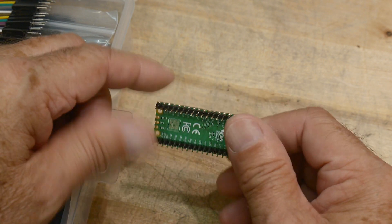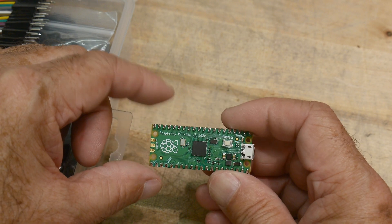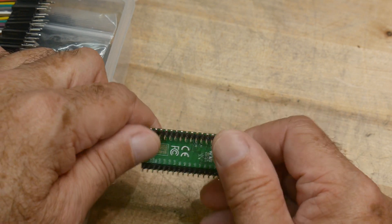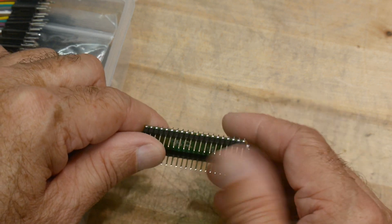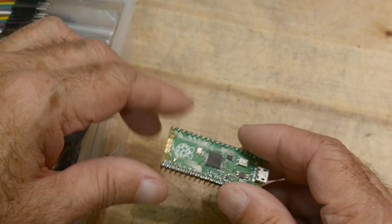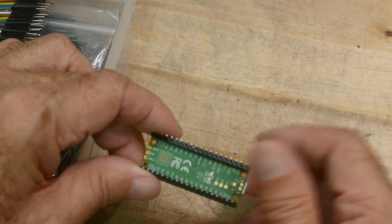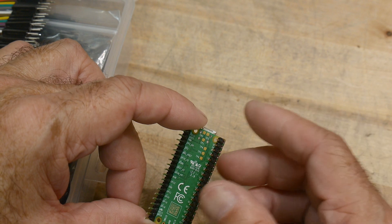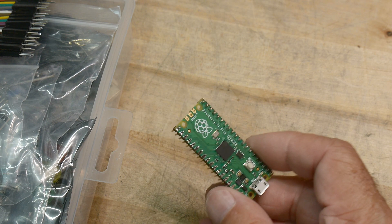It's about the size — a little bit bigger than a nano, about the size of maybe one of those blue pill boards. The board comes loaded with headers, so you can put it onto proto boards and stuff. It has lots of IO, lots of really high-end stuff — 12-bit ADCs, everything can be I-squared-C. It's just a very flexible design.